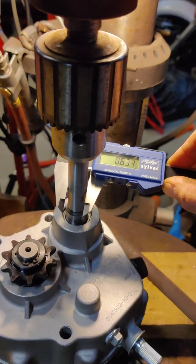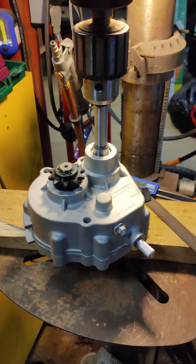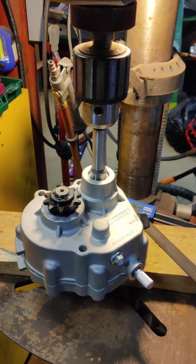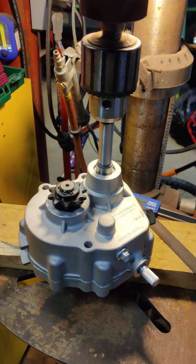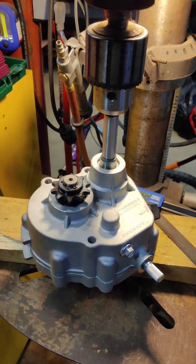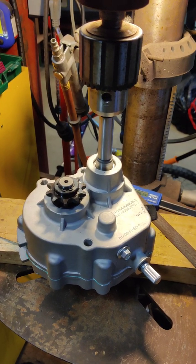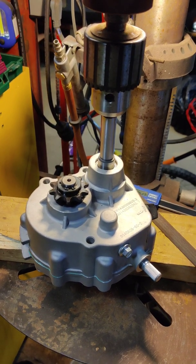For your reverse go-kart box, no matter where you get this thing from - eBay, Amazon, wherever - it's the same gearbox. Some people say 5 to 11 horse, some people say 5 to 13. We're going to strap it to a 420cc predator with a crazy low gear ratio because we're going to do mainly woods riding. We need a really really low end gear ratio.